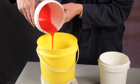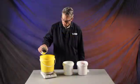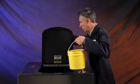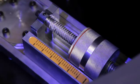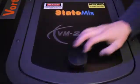To operate the Vortex Mixer, simply prepare the raw materials in a plastic container and place it in the holder. Adjust the counterbalance to match the weight of the material being mixed. Close the safety cover and press start.